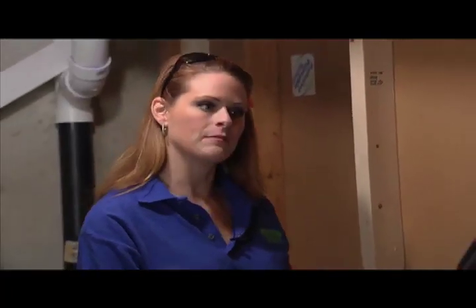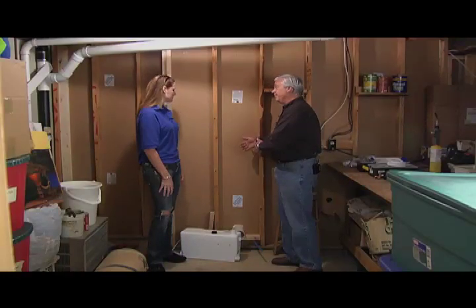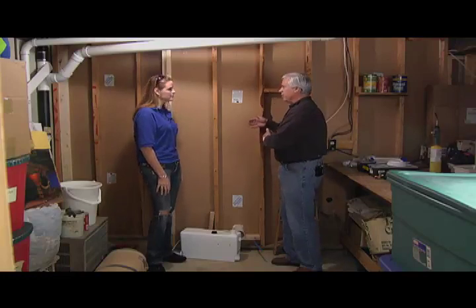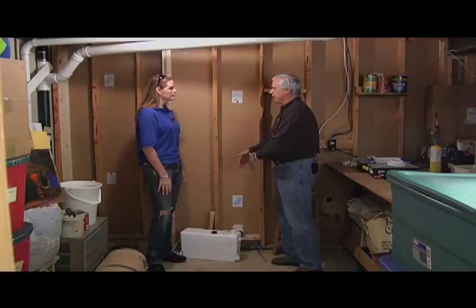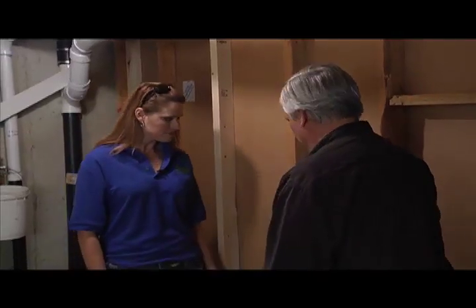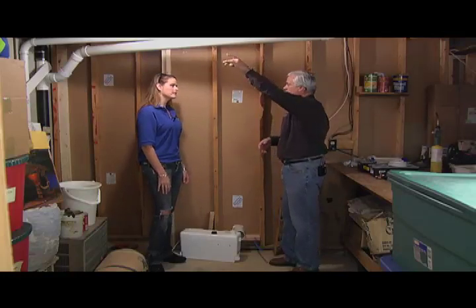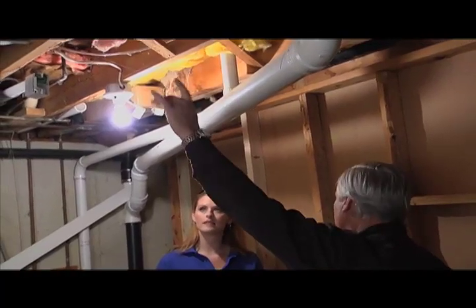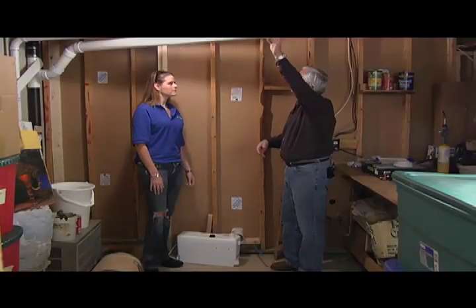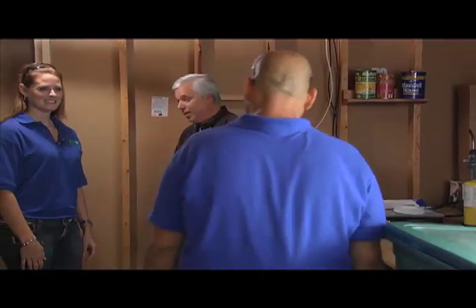So this piece doesn't have to be behind the toilet like you would normally see in a bathroom? It can do both. If you don't have enough room behind a wall to hide the pump you can put it in the bathroom. But in this situation that bathroom is going to look like any other bathroom — you're not even going to know there's a pump behind here, and the quietness of the pump will make it seem like there is no pump. This will pump up your sink water or your toilet water up into the drain. There'll be a vent going outside, and we're going to be cutting into the hot and cold copper pipes above, putting some valves in, and extending the pipes over to tie in the sink and the toilet. The star of the show is Ed and he's going to be taking us to finish on the project.